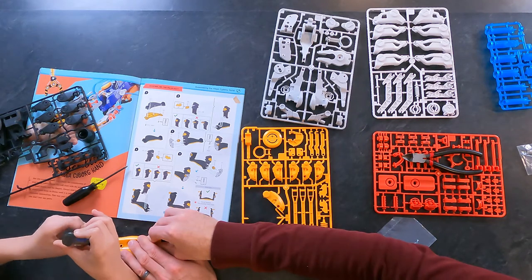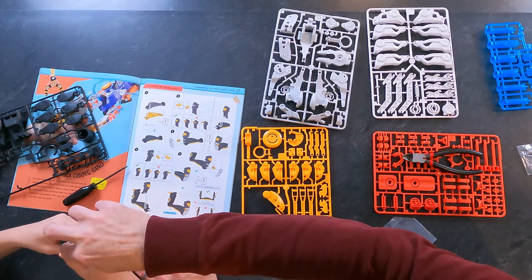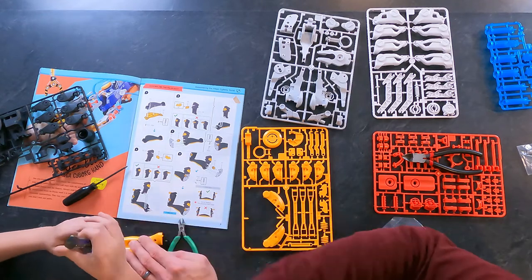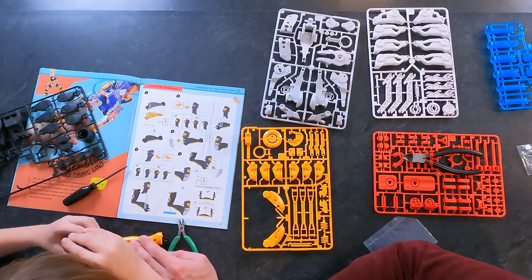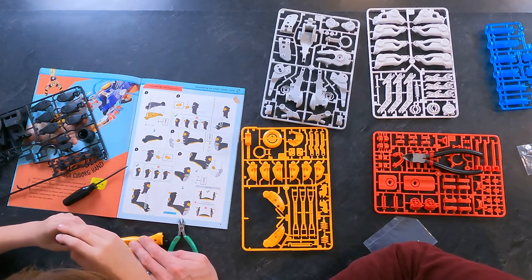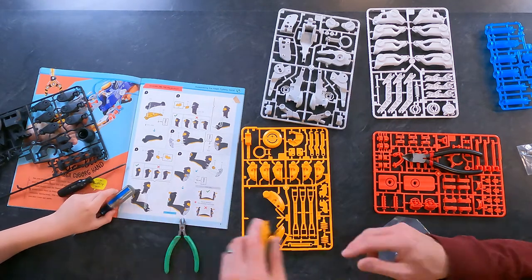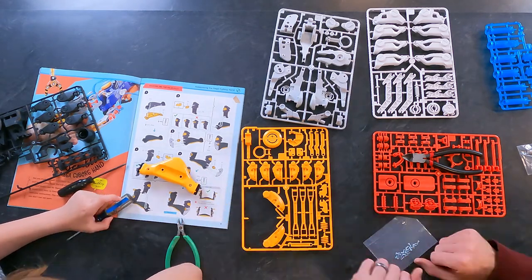I guess. And remember, you can always press down on the top while you're spinning it to prevent it from camming out. And for plastic, we can't make it gorilla tight because you'll strip the threads. So once you feel that it starts to get a little more challenging, then you know that it's tight enough. That's probably good. All right, one more? Good.